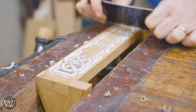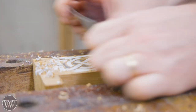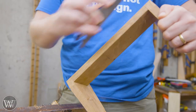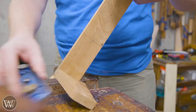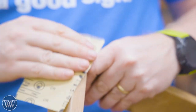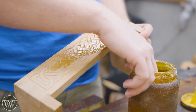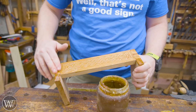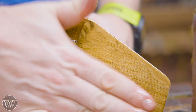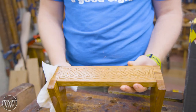Everything at this point is just doing the detail work. We're going to be doing a bunch of chamfers, because chamfers are what separate us from the animals. A nice block plane, run around the corners, clean it up, just soften the edges a bit — it's amazing what that does to make things feel better. I like using the rabbet block plane for doing these cut-in chamfers, as it allows you to get right up tight into the corner. Then I'm going to hit it with a very light pass of 400 grit sandpaper. This fills all the pores with dust, and that dust actually wicks the finish down into the pores a little bit better — you get more contrast than if you go straight off the plane. Then I coat it with boiled linseed oil, let it soak in as much as it wants, keep coating it on leaving it heavy, and once it stops soaking it up, wipe off the excess, apply some paste wax, and there you go.